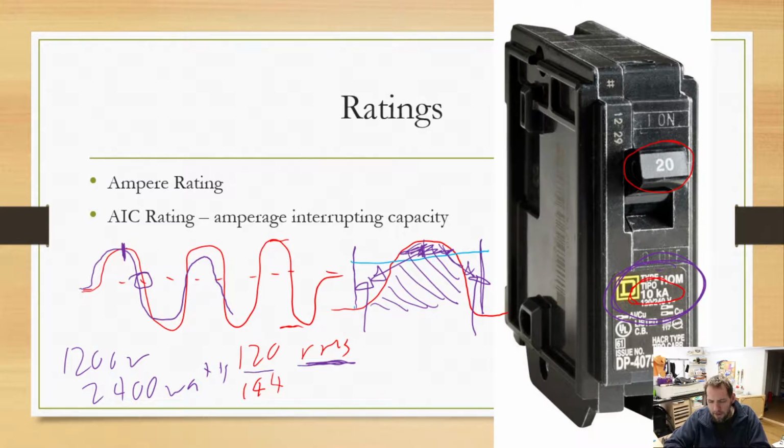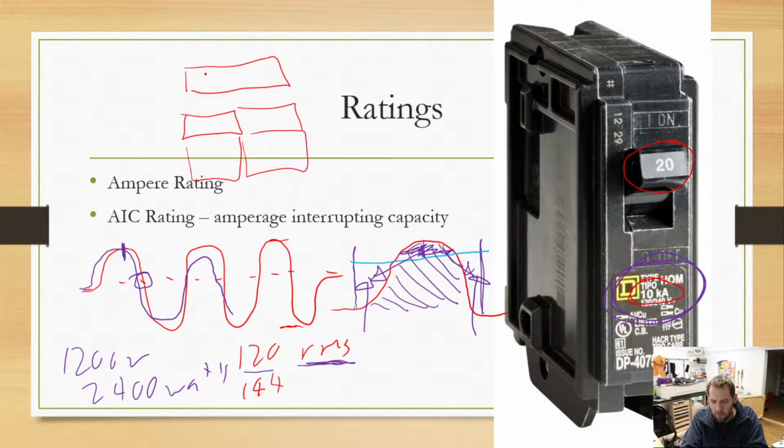In theory, your average homeowner, since we all have a master breaker in the U.S. at the top, which then leads to all of your little sub breakers down below it. So in my case, this is 200 amps. And then this might be a 20, this might be a 10, that might be a 15, all those other things. So in theory, you actually have two breakers protecting your house. Now, for you to trip this main one up here, it's got to be pretty stinking bad. That main one is meant to trip a little bit slower than all the ones below it, so that you don't trip this one when you have just a dead short on something. You always trip these little smaller breakers first, so that you don't have to black out your whole house if you make one little stupid electrical mistake. You always pop one of the smaller breakers first. So that is kind of like cascading breakers.